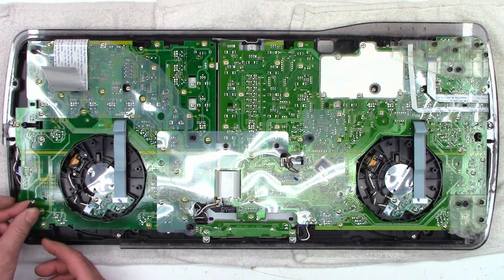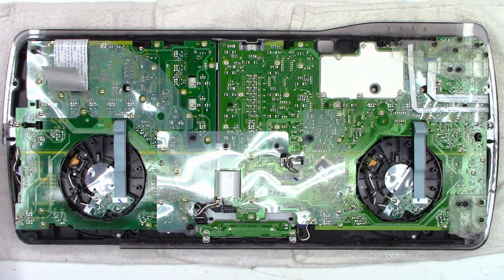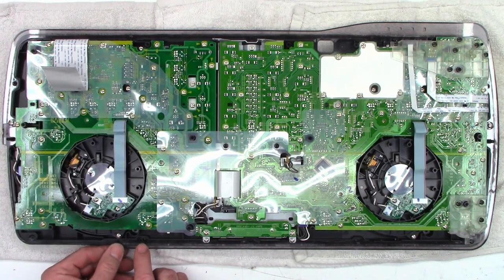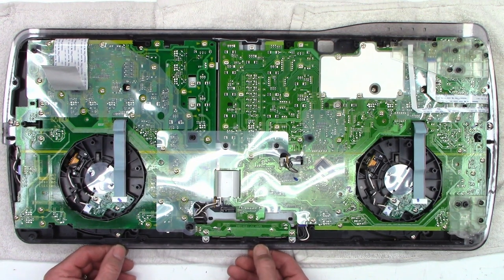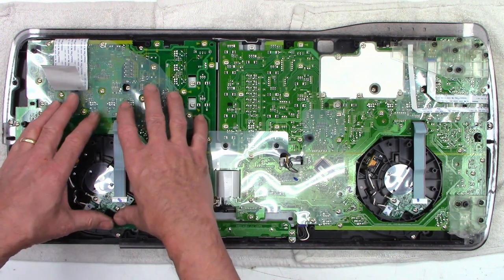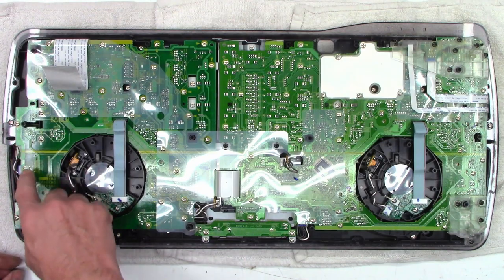This was broken off inside the unit right here — it definitely attaches right there and I think it's meant to hold the plastic piece down. There's another broken piece right there, and this little standoff is physically broken out. This one is wiggling — it's loose. That one right there is missing. So I'm wondering if this thing had some physical abuse. I need to go ahead and completely remove this board to gain access to the pot, which lives right under here.